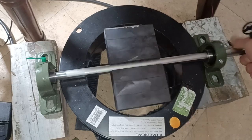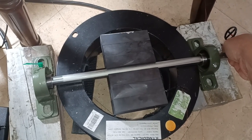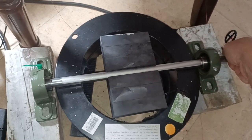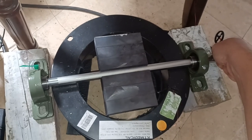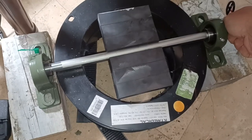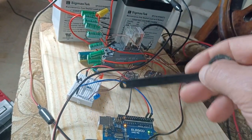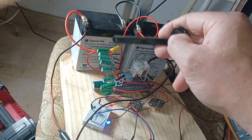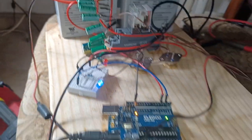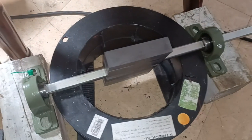When it lands here during the off cycle, the coil is disconnected from the circuit and not being induced with any voltage. During that period in the cycle, the north and south sides of the magnet are facing the arms of the coil, charging the coil with magnetic field from the magnet. The coil has flyback diodes funneling back to the battery, so the flyback is hitting the battery. It doesn't really get to the capacitor bank until the red LED closes, and then whatever flyback doesn't hit the battery lands in the capacitor bank. There's also a 450-volt high-frequency capacitor in parallel with the 24-volt super cap.